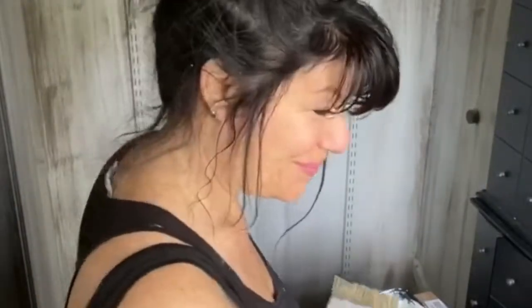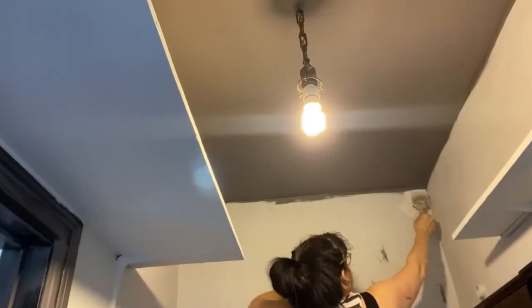Anytime I'm painting a small room I always use a paint pad. They are a little tricky because they will accumulate paint on the edge and start dripping. Some people don't like that, but as long as you learn how to use them by tilting the edge and then painting up instead of down, they work amazingly. Rather than buying buckets and new containers, I usually just use a to-go container. Right now I am edging in everything, even though I'm going to faux finish. The nice thing is I won't need a crisp edge — just a little touch-up.